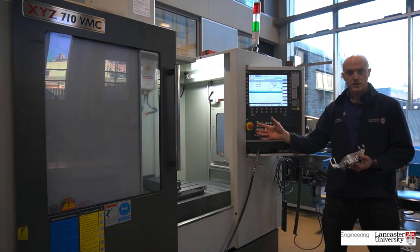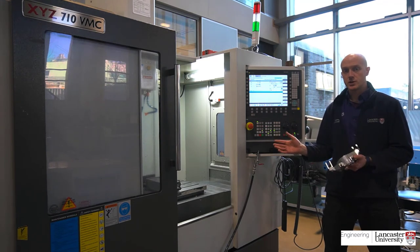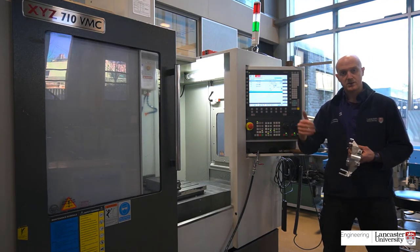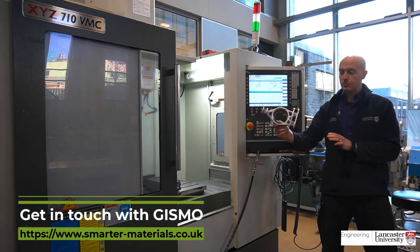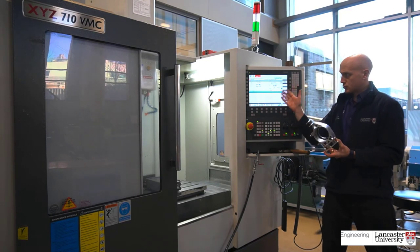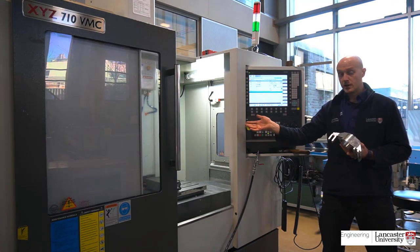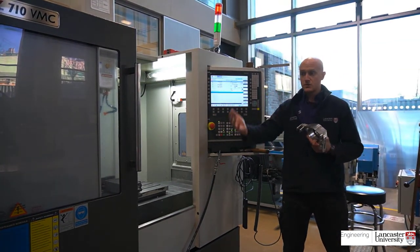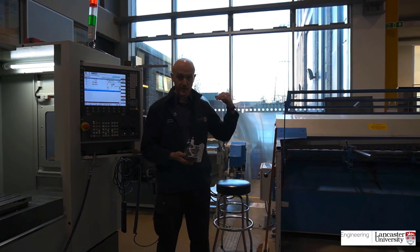This is another one of our CNC machines — our XYZ 710 VMC. This is a much larger CNC machine with a 710mm workspace area. It also has box slideways, enabling us to take bigger, deeper cuts in whatever material we are manufacturing, so we can machine bigger components. It enables us to make things like uprights for racing cars out of 7075 aircraft-spec aluminium — extremely quickly and extremely precisely. It also utilises Siemens' latest 840D controller, which will use 5-axis simultaneous machining. As well as housing the CNC machine, we have a hydraulic folder, enabling us to fold sheet steel and sheet aluminium up to 10mm thickness, and a hydraulic guillotine to cut the material before we fold it.